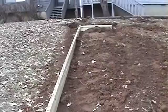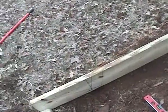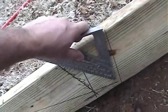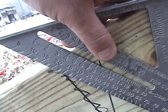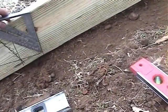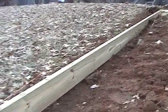All right, we're making some progress here. I've got one of the rails for the stairway installed. I drew a line across here, found where the level was, and the angle of the steps is about 20 degrees. So I'm going with that — it's twenty-two and a half inches on the step and then about seven inches rise. Twenty-two and a half — it's kind of a big step, but it's coming along.